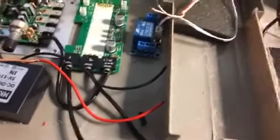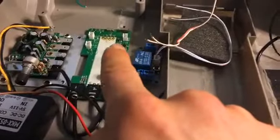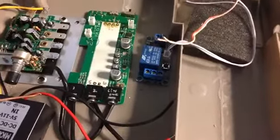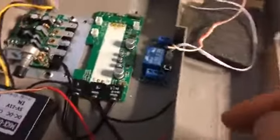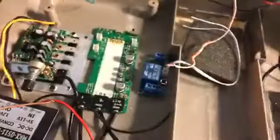The way that I'm going to wire the sound is, instead of trying to desolder all of these parts off of the board, because it's tough to do with these unless you have a desoldering vacuum, which I really wish I would have had. I'm going to invest in one of those because it makes it easier for removing these things and not burning up the board. The other way is just too hard with desoldering braid or a solder sucker. It's not easy on these boards. These contacts are so delicate that with too much heat the actual contact just rips off the board, and it's not fun to retrace or make jumpers and things of that nature.